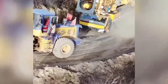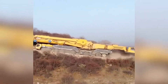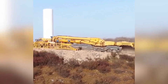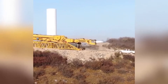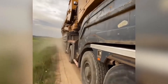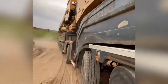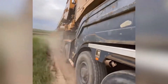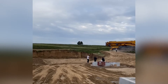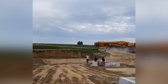The road leading to the installation site should be smooth. The installation site of each wind turbine has enough area, and the site is flat with an area of about 40m to 60m, suitable for the operation of one main crane and one auxiliary crane. The main crane is located in the main wind direction or the reverse position of the wind turbine foundation, and the auxiliary crane is located according to the needs of the operation. The hoisting machinery and hoisting tools required for installation are complete and can be used in the project only after passing the inspection.